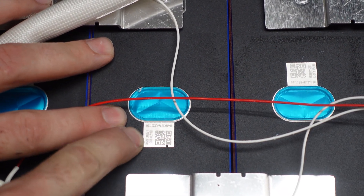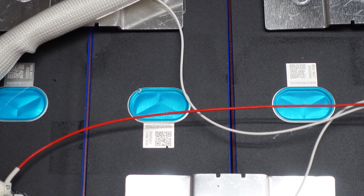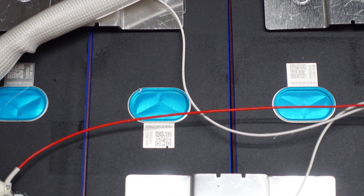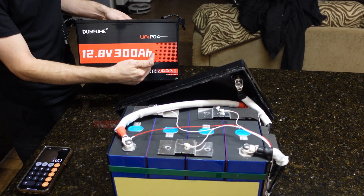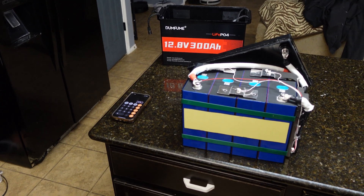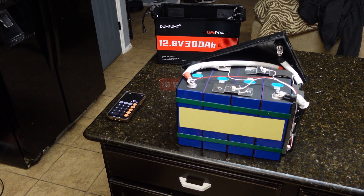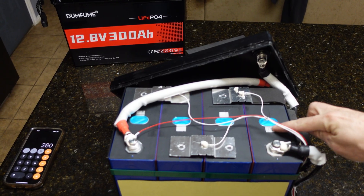The cells are marked 'LF 280K, 896 watt hours.' Doing the math — 896 watt hours divided by 3.2 volts nominal — gives us 280 amp hours per cell. It's impressive we got over 280 amp hours in our test. However, this does indicate that the '300 amp hour' label is more or less a lie — it's really a 280 amp hour battery. I figured as much since I don't believe they make an exact 300 amp hour cell.